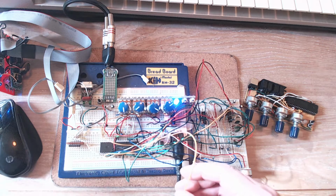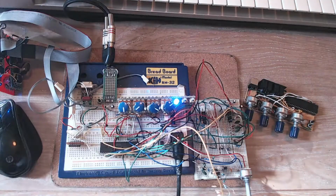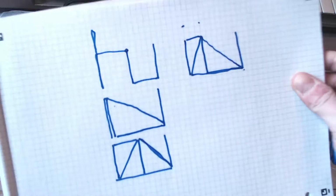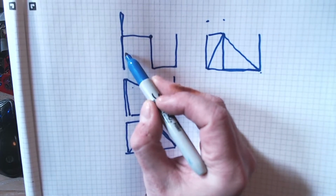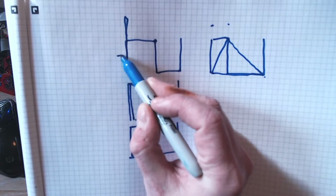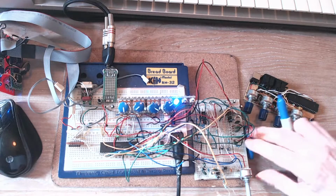I know what it does. I'm just trying to figure out where it's supposed to go in the circuit. What this does is that the square wave goes into a digital to analog converter, and then is reduced relative to the center, so that it comes out like that, which is the coarse ramp control.